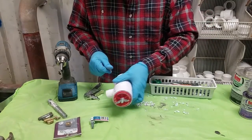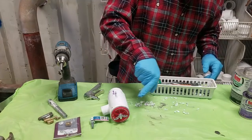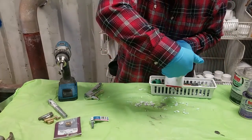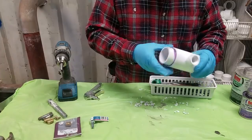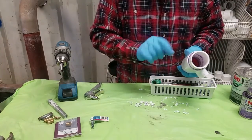Why are you putting a second layer in a pipe? Because I want it to be super strong, because I'm going to drill and tap, so I can put an air jet perfectly aligned right here, shooting out that way. And I'm going to drill and tap this, and when I screw into it, I want there to be a lot of meat there for the threads to catch.